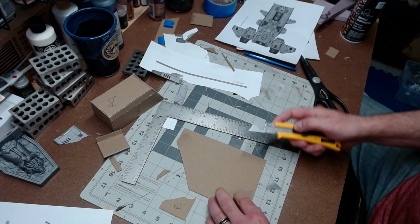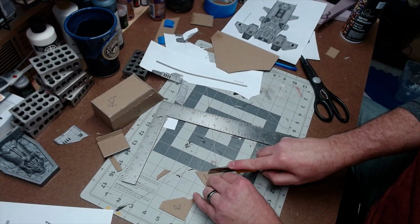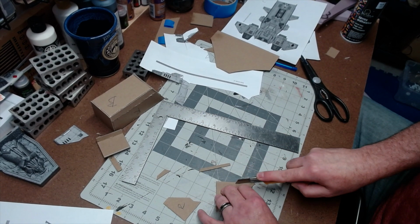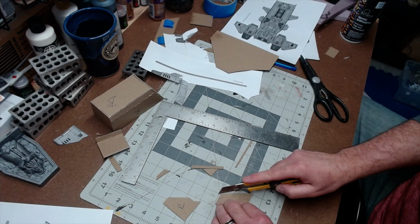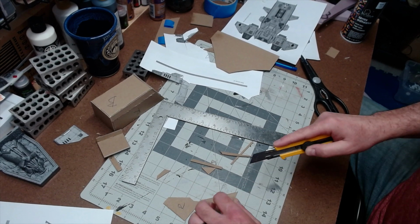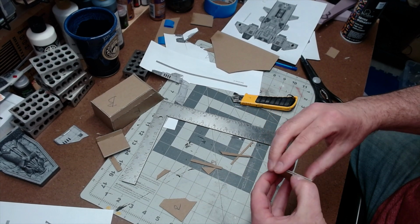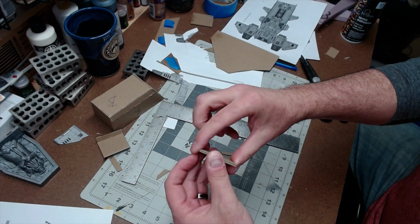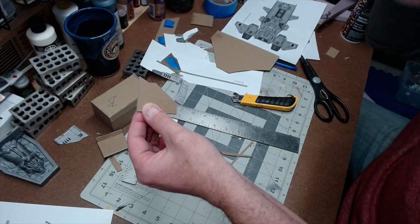All right, so put it in place. Follow the edge. Try not to cut your template. Just use the edge of the template to guide your blade. And you'll have one final chance to make sure everything's matching, because when you get done, you'll put the right and the left side together and make sure that they fit well, or that they match. All right. So take them, put them together. And I did pretty good. I don't see any real major glaring errors here.